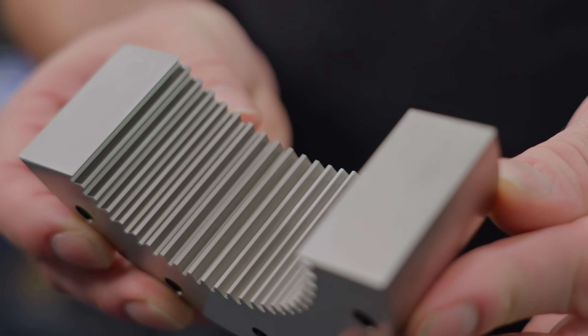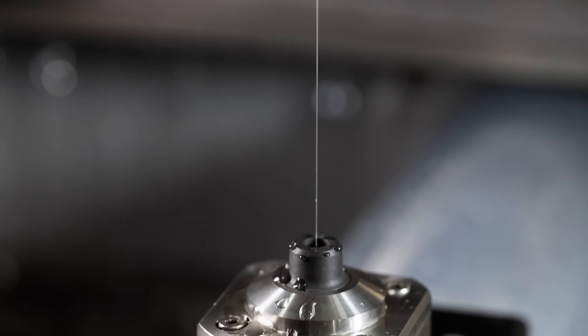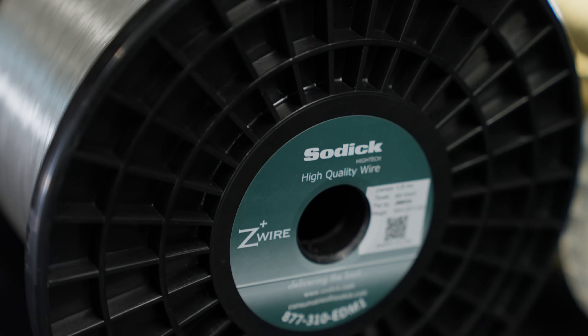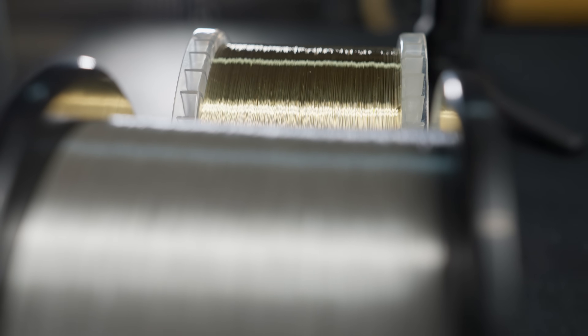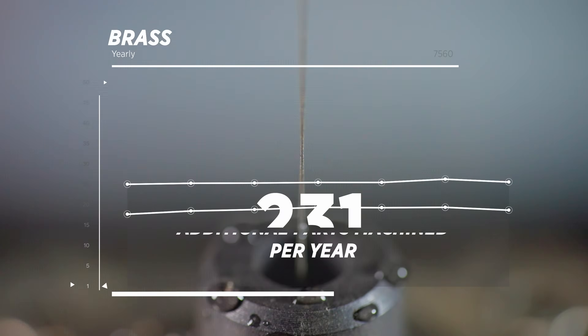You're not going to see 30 percent savings consistently for every single part. Depending on the part's thickness, material type, or geometry, you might see anywhere from 10 to 30 percent. But at this point it's undeniable that when you switch to a premium wire like the Z Plus wire you are going to shave your cycle time, and when you use technology like iGroove you're going to save on your wire usage. When it comes to notoriously slow technology like Wire EDM, being able to simply change out to a different wire, shave that cycle time, and get more parts out the door is really crucial. Thank you for watching — I hope you enjoyed the video.